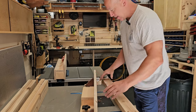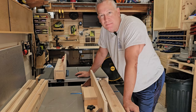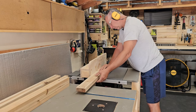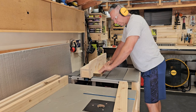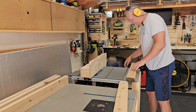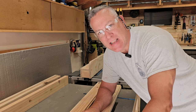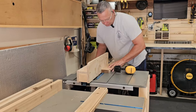A couple of reasons to use the table saw instead: one, I could do everything in one pass instead of a couple passes to get to the depth that I want. Two, I have better dust collection on a table saw — I don't have any dust collection really for the router, and that's going to be a lot of routing. So I already put the dado stack in and I'm going to get ready to do our first pass. I'm going to make the marks for the inch and a half, two one-eighth inch blades inside there. If I cut that right down the middle, that'll give me an eighth of an inch on both sides and that should make it evenly spaced out.